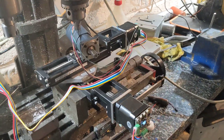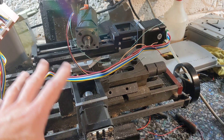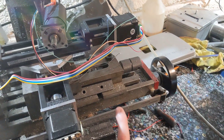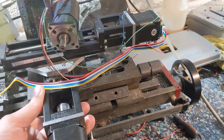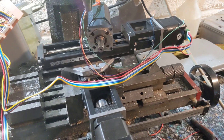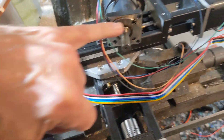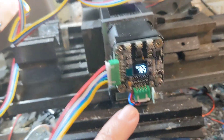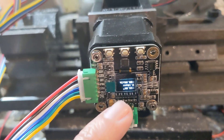We've just been having a look at this creation here, which is going to be an XYZ machine, CNC operated, that bolts onto the bed of any machine. It's going to be super accurate. The reason it's going to be super accurate is that these ball screws have got a very high degree of accuracy, and these stepper motors have got a feedback loop on the back that tells you the position and how many degrees they've traveled.